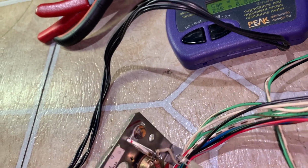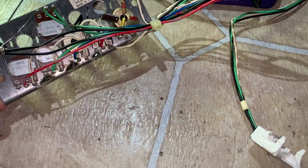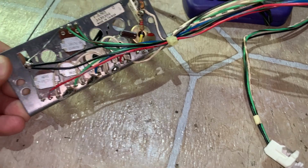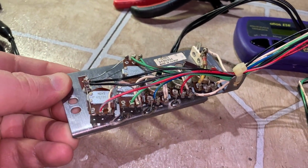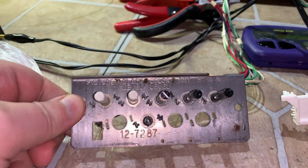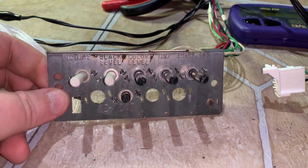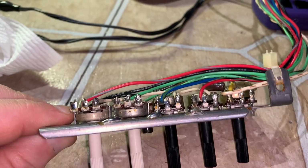I mean, let me see. This is off of the sharpness control. So all I needed to change in there was that electrolytic there. Spray some DeoxIT in all the controls and mount it back in the TV right there. Another thing I like to do is, in addition to spraying it on the actual wiper and the contacts in there,